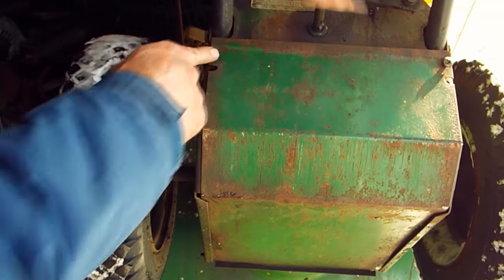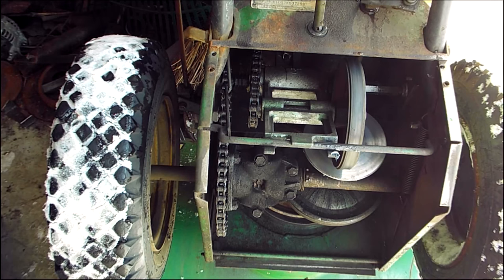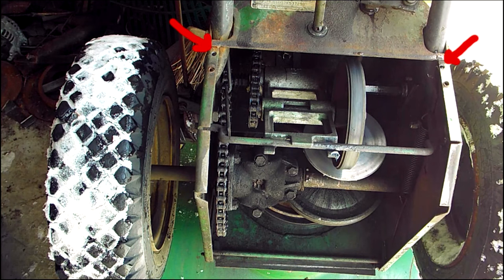Here are the screws that I use — here's one of them. What I'm gonna do is, I could weld in the holes on the top part of the back of the frame, put some weld in there, drill them out with a smaller hole so I can re-tap them with some metal screws. Or I can use these bottom sets of holes that are a little bit bigger — I found a bolt will probably slide right up through those holes and I just need to find a way to keep them in place, maybe using the welder.